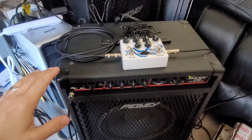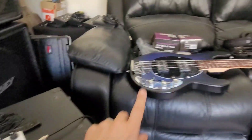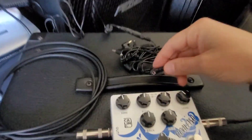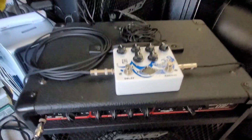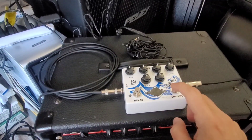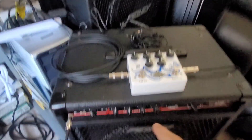Here's a simple example of what I'm referring to — what an inferior pedal power supply with a daisy chain will do to your sound. We have the amplifier and an effects pedal — a chorus and delay modulation effect — connected to my guitar going right into the input. We're going to connect the daisy chain to the brick here. What you're hearing is a ground loop. That's because your amp is grounded, so is the power brick through the neutral, and this is now causing a circulating current to produce that noise. It doesn't matter if the pedal is on or off. This is the problem you get with a typical daisy chain, and if you added more pedals, the noise would get far worse.